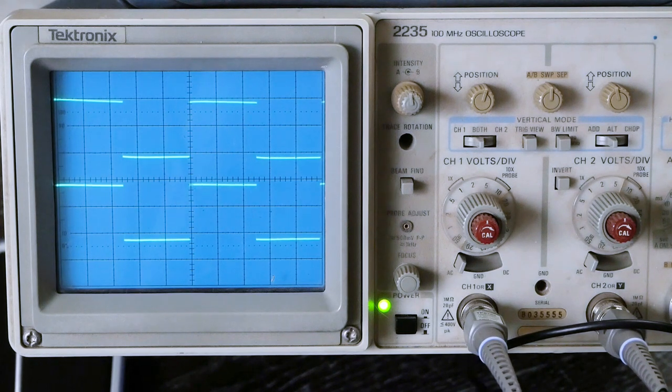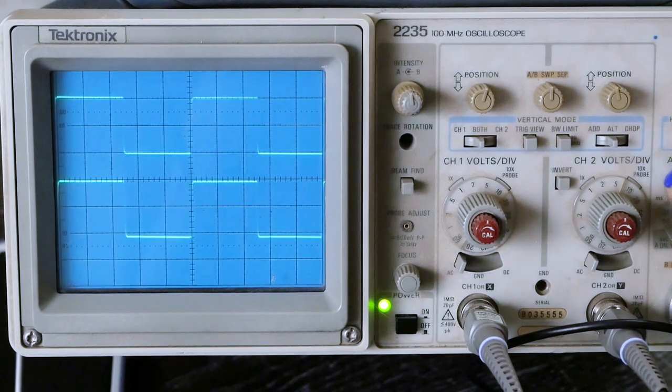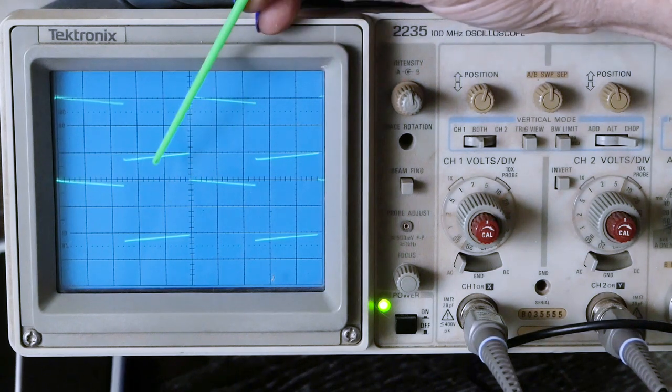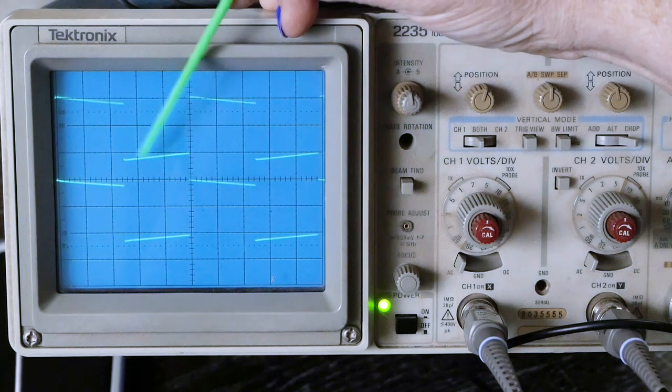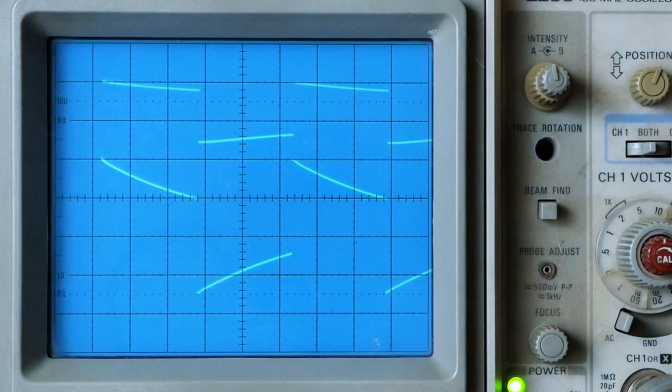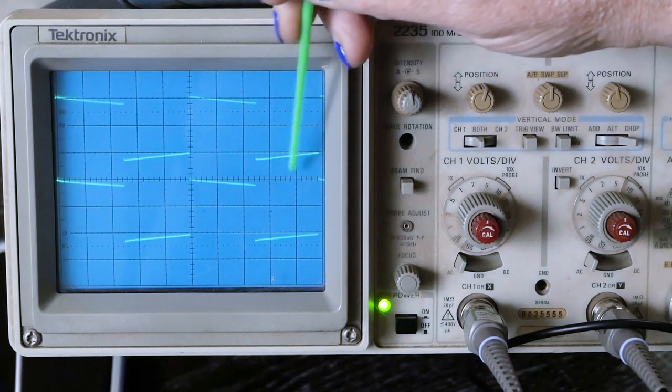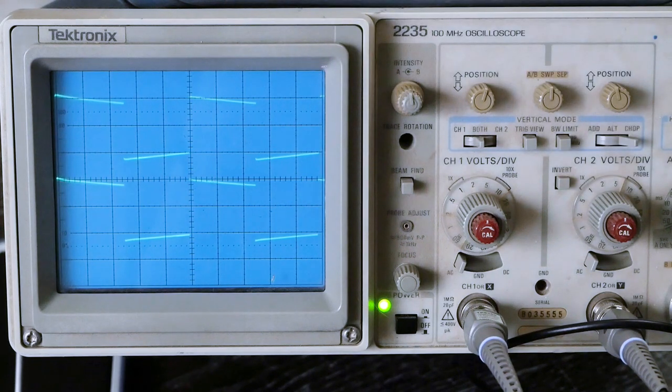There it is at 1K — that looks beautiful. No ringing. Everything looks good. Let's jump up to a 10K signal. Again, the square wave looks beautiful — nothing there to be concerned about at all. That's a nice square wave. Let's go down to 100 Hz, since that's where we were seeing the problems before. My old analog signal generator is struggling to get a really clean square wave, but these were like super angled before on the output. You can see now they're mirroring the input from my signal generator one for one. Going to that larger coupling cap totally cleaned up the square wave on the output at 100 Hz as well. So I think this is a win.